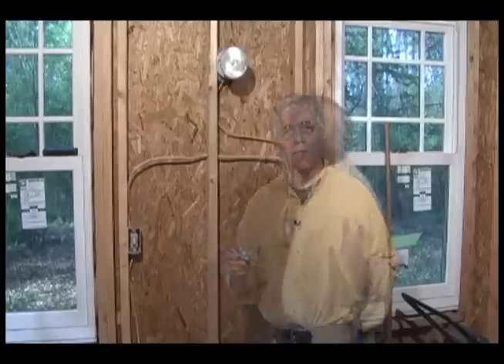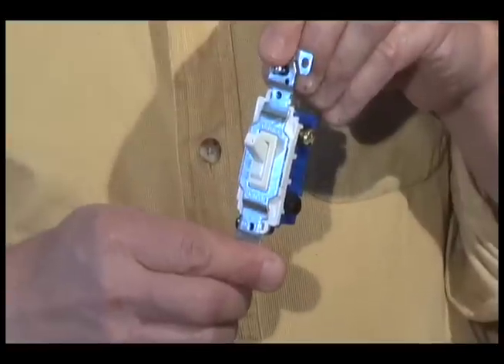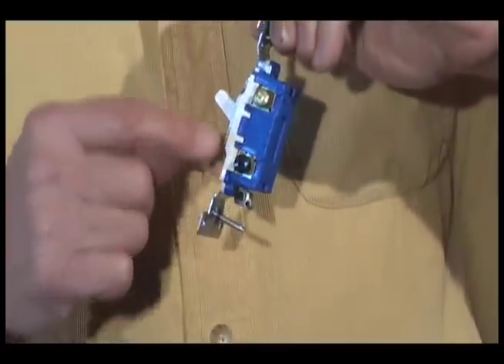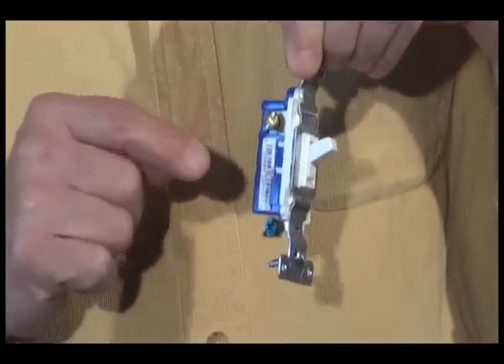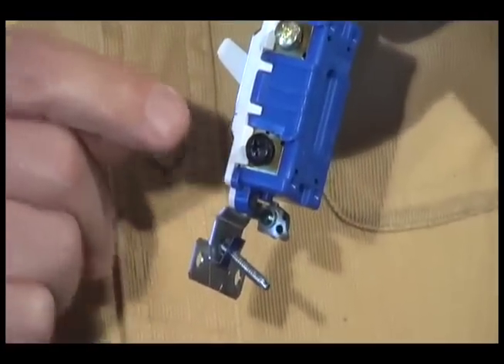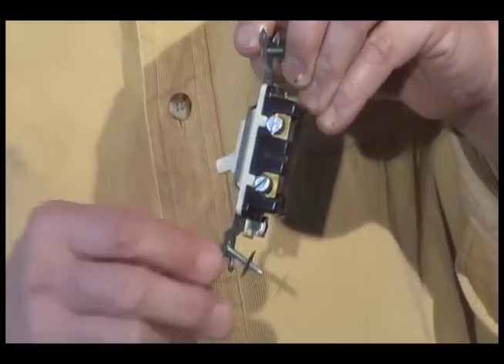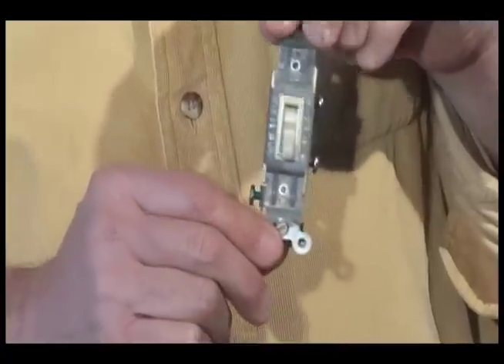I don't want you to get electrocuted. Three-way switches can be found in many homes and they're very useful. They allow you to control a light, or maybe several lights, from two different locations. But the problem is they look a lot different than a regular switch. A three-way switch has got three screws — one, two, and three — plus the green grounding screw. This black screw right here is the really important one to pay attention to. A regular single-pole switch has just two screws and the green grounding screw, which is very different. That third wire can cause three-way switches not to work properly if you put the wires on the wrong screws.